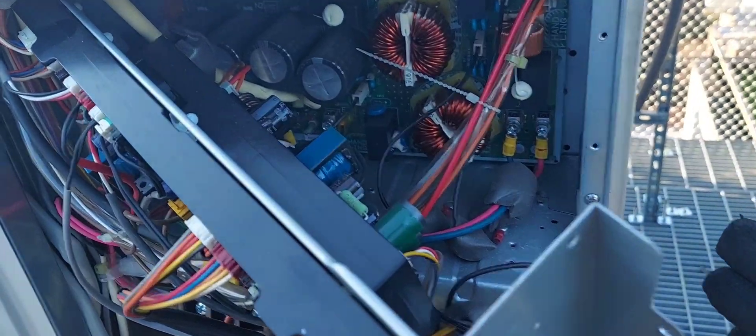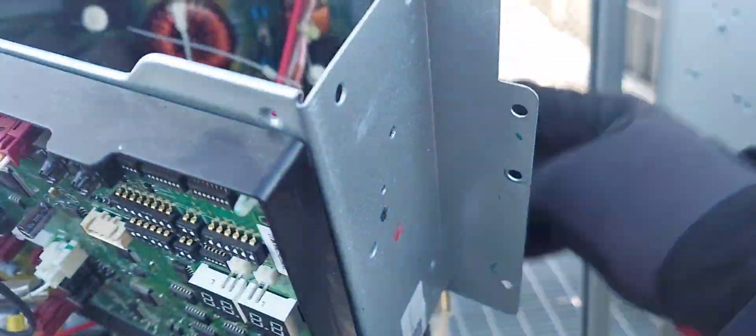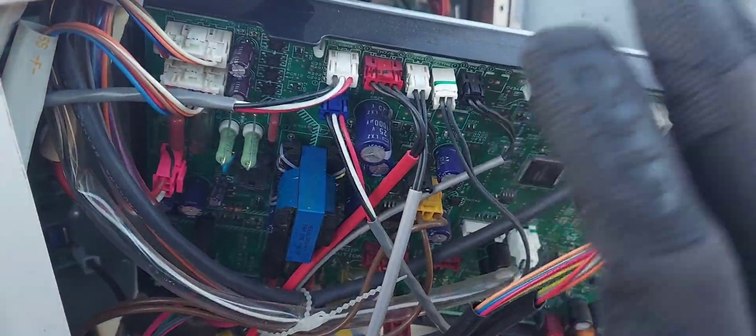Diagnostic for the compressor is complete. I'm going to recommend replacing the PB board and the IGBT board — the IGBT is attached to the back of the PB board. Remove the screws on these sides and there are three small metal clips on the back of this plate. Unplug your wires from the main board and you're set.